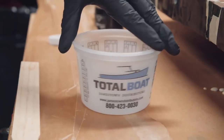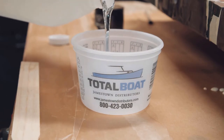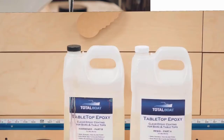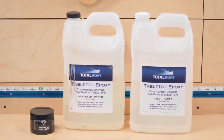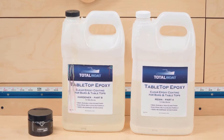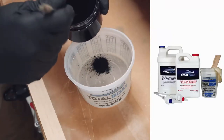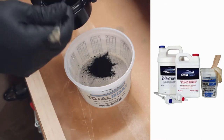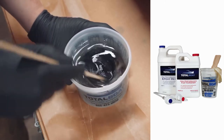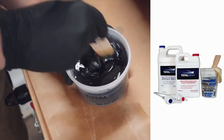Now let's talk about epoxy and specifically how versatile this Total Boat epoxy is. For a relatively small epoxy pour like this, the recommendation is to use Total Boat's high performance with slow hardener. However, Jeremy brought the tabletop variety - as the name implies it's best suited for tabletop applications, but its characteristics will also play well here. Because Jeremy has a tremendous amount of experience with this exact epoxy and because we have more of it on hand, that's the route we're going. The high performance resin system is thinner - it'll seep into little areas inside the crack better and set up a little bit faster. The tabletop is thicker, meant to self-level, so it's better suited for top coat applications, but as you can see, I trusted Jeremy's experience and it worked just fine.